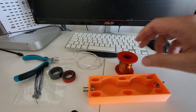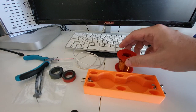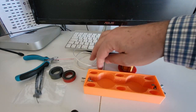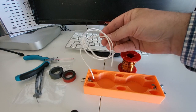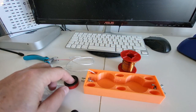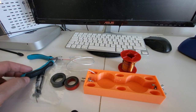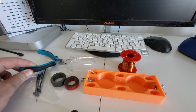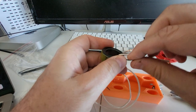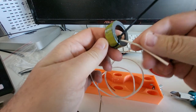I think I have everything I need here: my box with the BNC connector and little wing nut, 1mm enameled wire, some RG316 coax, my T-106-2, and my FT-140-43. First thing to do is immobilize my coax using a tie wrap. That counts for one turn.